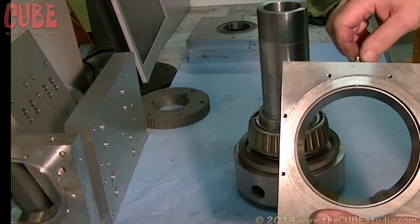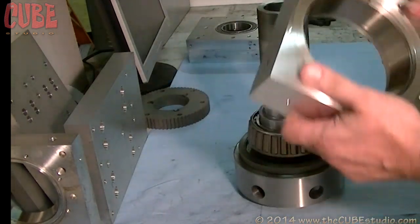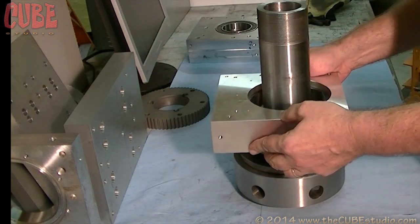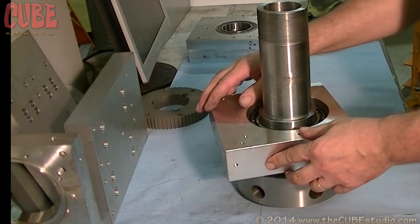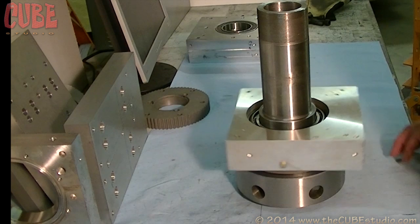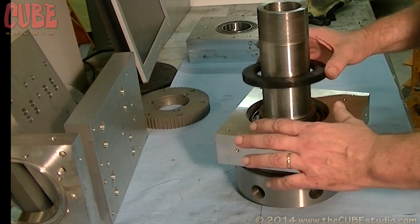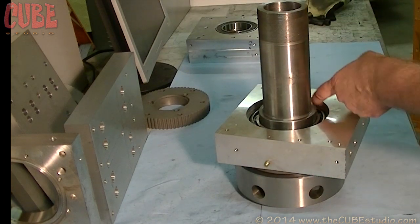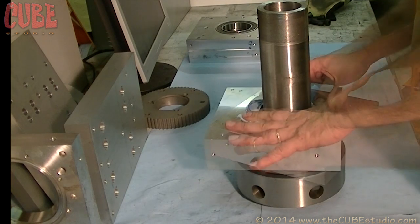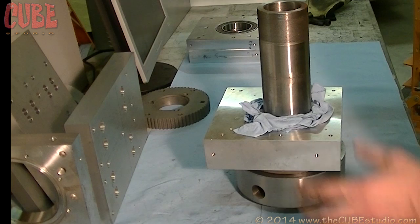In order to maintain this, you'll be pumping grease right in here and once it gets in there it'll distribute by itself. This assembly then goes on carefully — you don't want to bang these around. You can't tell on the video how incredibly smooth this is; it's absolutely smooth. After the bearing is packed, this will just press into that recess and ride on the shaft. The rear bearing is a tight slip fit because it has to be able to move so we can preload the bearings.